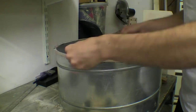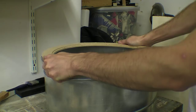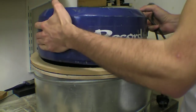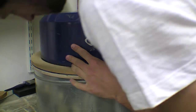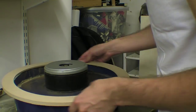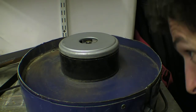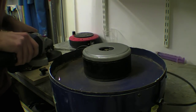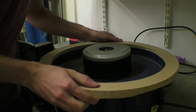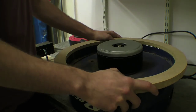It would have been more accurate at the time of cutting the rings had I done this with a router or even a jigsaw. You can avoid rebating for example by cutting the rings in various thicknesses and gluing them on top of each other. Once I had the rings I went about dry fitting them and then grinding down any high points on the metal that I had previously cut. I did this by scribing lines within the open drums using the caliper against a flat base and checking how the rings sat.